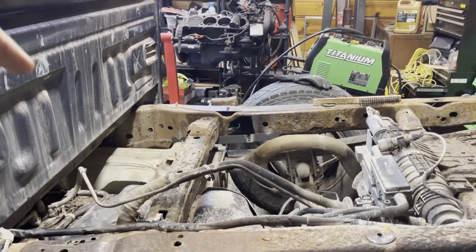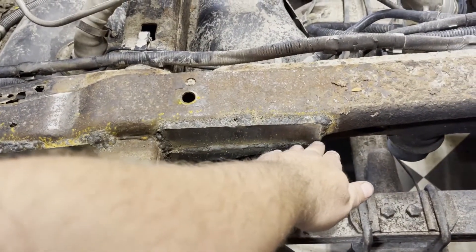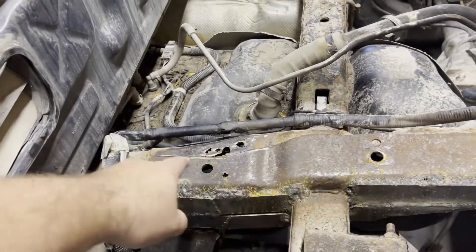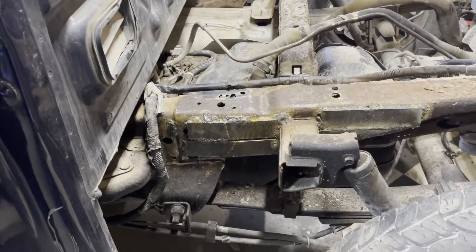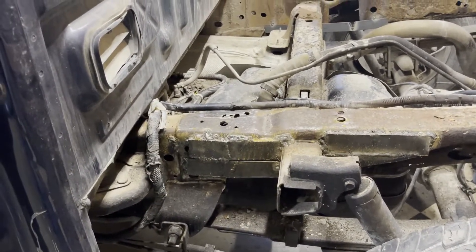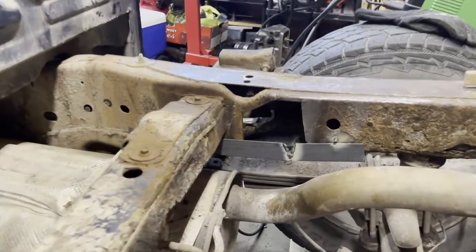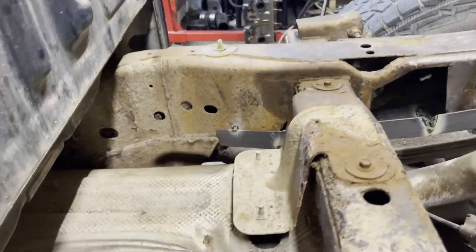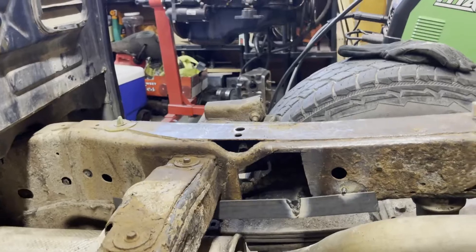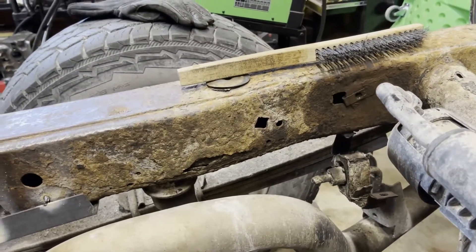I had it the other way around in here and there's just nothing there — literally the top of the frame is all that was there. I booger-welded these 3/16 bars on here and that got it held up good enough. On the other side I've done a little bit more work — you can see I got some angle iron down here, I'm kind of rebuilding the bottom of the frame. I just started that, and I got some plate I'm going to fill that in.